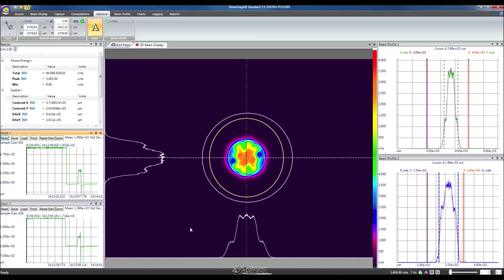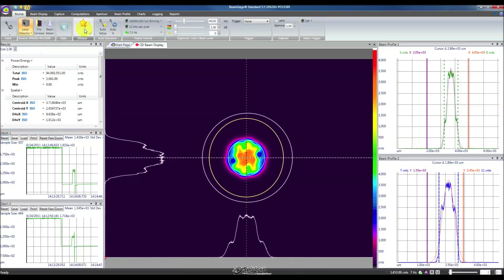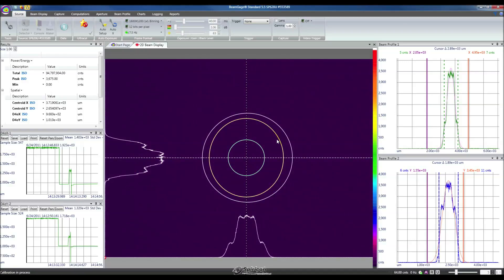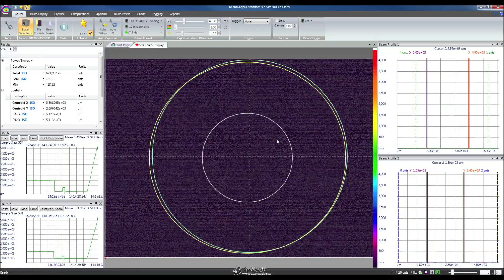At this point, we are collecting fairly close values — pretty close to the historical numbers for this laser, but still not quite. What we really need is to do a background calibration. We're going to use UltraCal, which is Spiricon's patented background calibration process, and it's pretty easy to use. We'll just do a single click on the button. It starts the process, generates a signal-to-noise ratio, and then it wants us to block the beam. It automatically continues the calibration process when we block the beam, and depending on your camera's current frame rate, the calibration will complete very quickly.